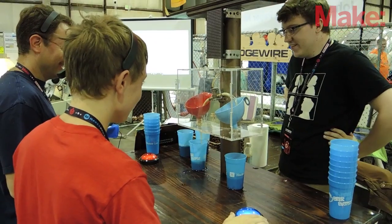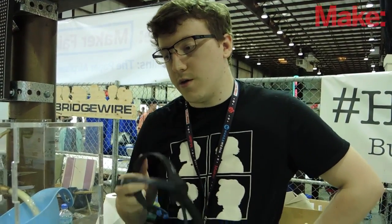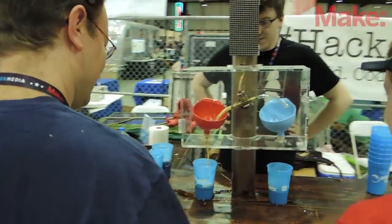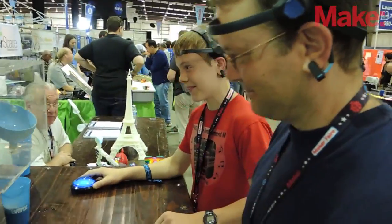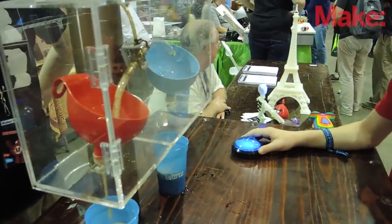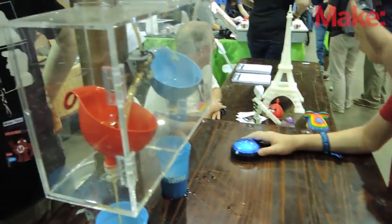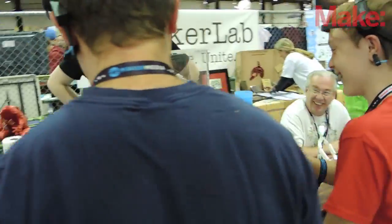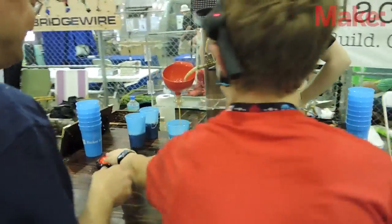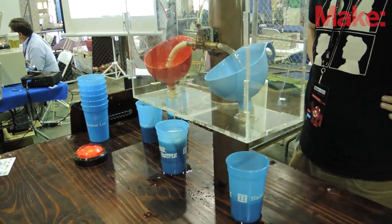It's built using three Arduinos. Two are to pick up the Bluetooth from the headsets and the middle one to do all of the game work, including the screen — which isn't really operating right now — but it controls all the logic of the game. We have an electronically controlled valve that begins and stops the game, and we also have a servo in the middle that controls the tilt to determine who is getting root beer at what time, which is based on the headset input.